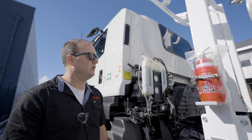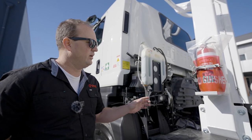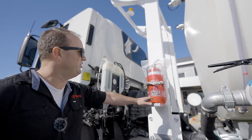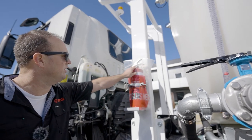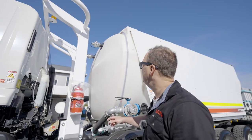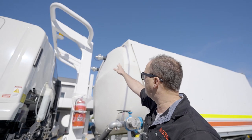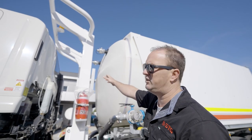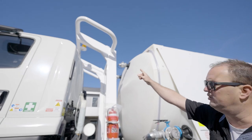This truck is fitted with a rollover protection system (ROPS) for mining in Australia and most mining sites around the world. On this ROPS, it's fitted with a nine kilo fire extinguisher. On a daily basis, we want to check the fire extinguisher is in good condition — a quick look at the gauge shows the needle is in the green, meaning it's fully charged and ready for operation. All STG tanks are fitted standard with front batter sprays, so just a quick visual look — check that the airlines are on and check if there's any rocks stuck in the slits that could obstruct the spray. Check the ROPS flashing light is in good condition and ready for the day's work.